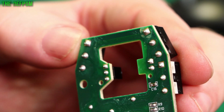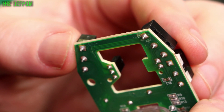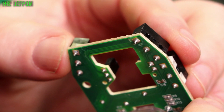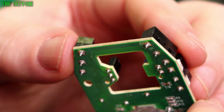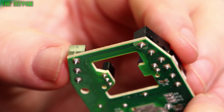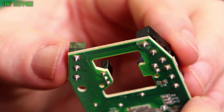Just very slight, maybe. Can you see it just there? That shows up quite well actually. I think it's cracked. Quite possible. So I think I'll resolder the joints on these switches, and chuck some cleaner into it as well while I'm at it, and see if that solves the problem.